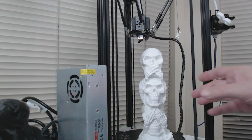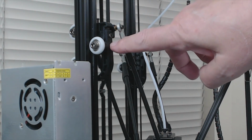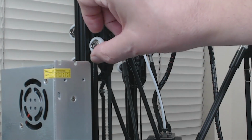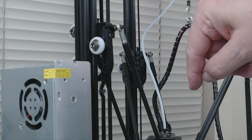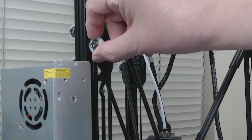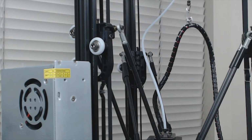What's the bad thing about it? Well, there was one thing that was a problem. Here in the skate is an adjustment for tension on the roller wheel. The instructions don't mention anything about adjusting this tension in order to tighten the wheels on the rail. But in order to get precision out of it at all, you have to tighten this down so that the roller bites into the aluminum without slipping. And the instructions did not include that information.